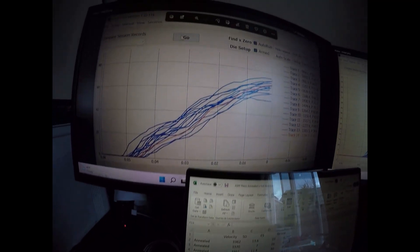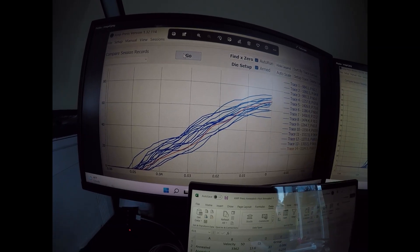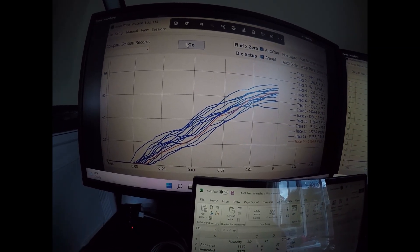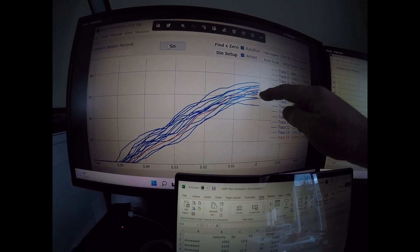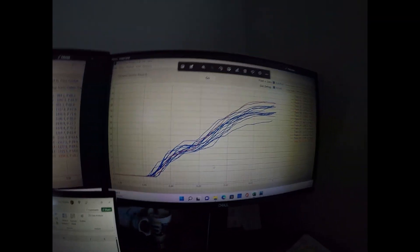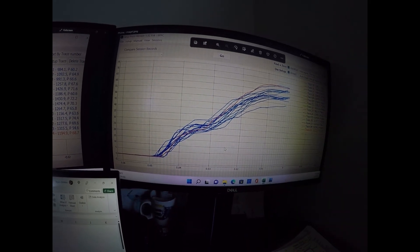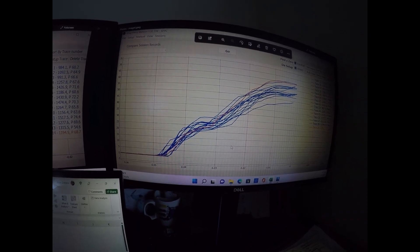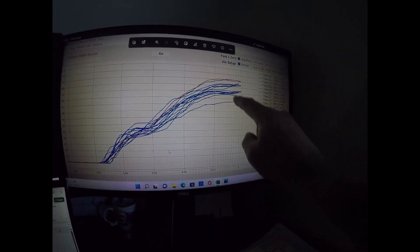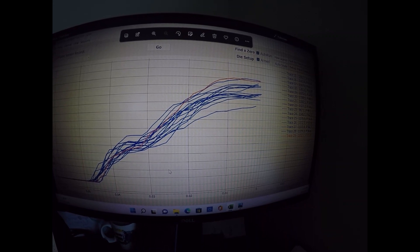The interesting thing is the shape of the curve — almost perfectly linear with the annealed brass, but requiring more pressure to achieve the final seat relative to the not-annealed brass. The not-annealed showed a much more pronounced dip near the middle of the seating process, and then had much lower pressure needed to do the final seat.